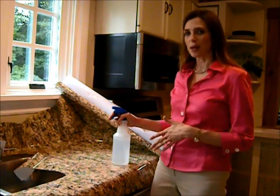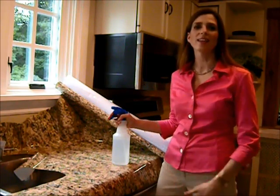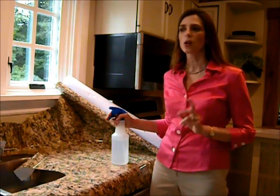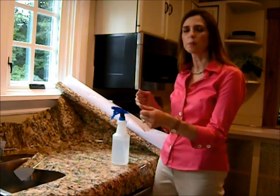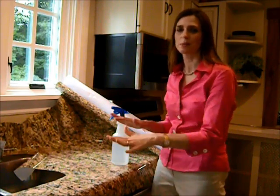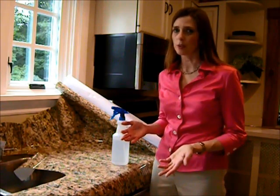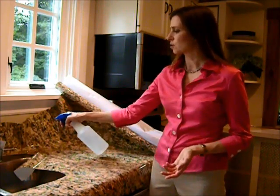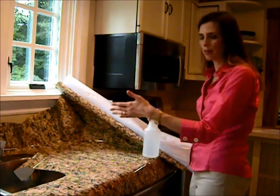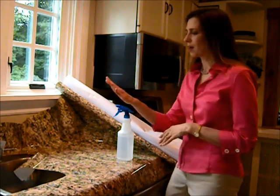So I'm coming to the end of my run here, and I won't lie to you, on a very long run like this, it's a little bit like wrestling alligators. It does help to have one or maybe even two people here just to help you pull apart the film so that somebody can spray, somebody can pull apart, and somebody can lay down the film as you go. But really, this only took us a few minutes, and you want to make sure that you're spraying the backsplash and all the way underneath so that as you get through here, you still can reposition the film.